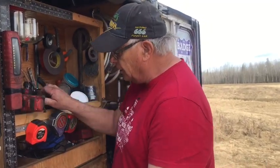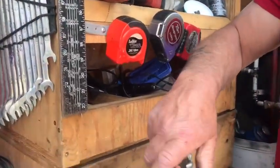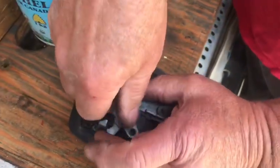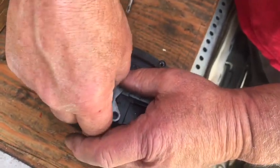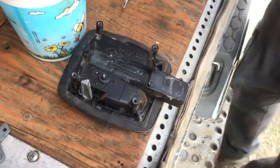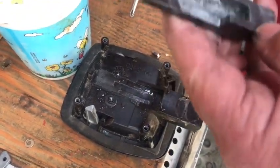All you do is take out one screw and the bell crank right here. Drop the screw, take the bell crank off, and it all comes to pieces. Watch — there's a spring in there.